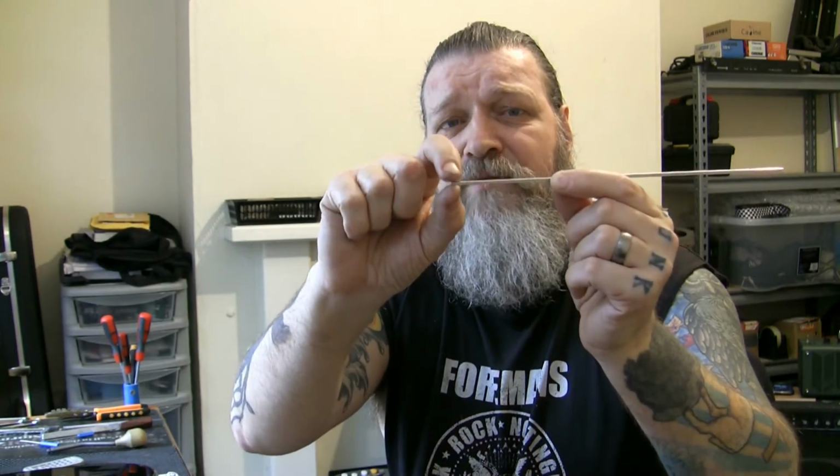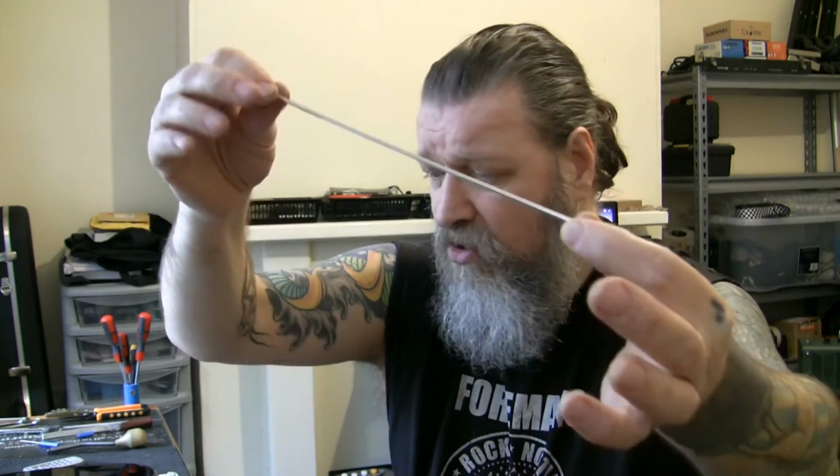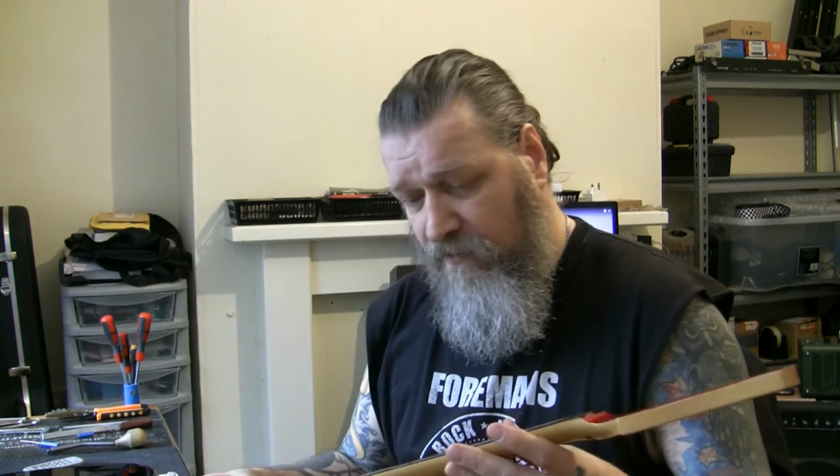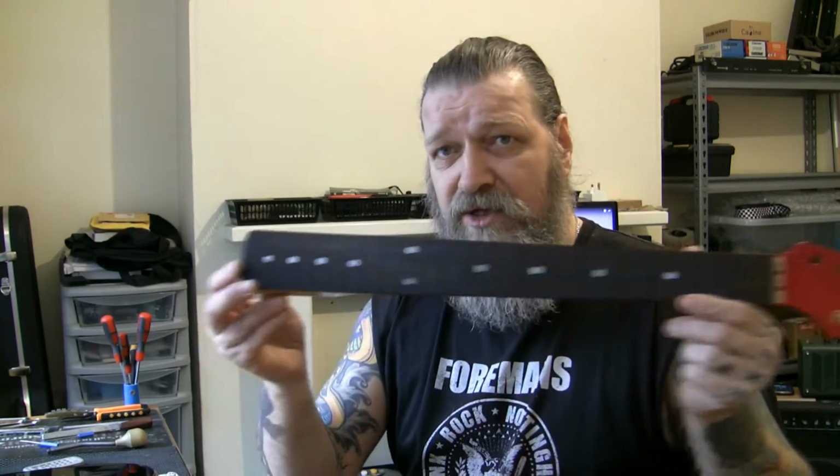The tang itself, I'm not sure what it is, it's about 1.6, 1.7 high, maybe a bit more. So it's going to be about 3 mil high including the tang. Beautiful, beautiful fret wire, long lasting, hard wearing. So I'm going to get that on and start that job today. So that really is it. This looks absolutely wonderful. Really, really pleased with how it's come out.